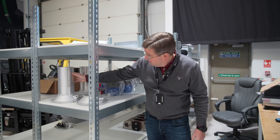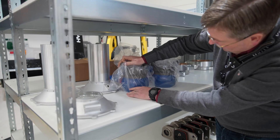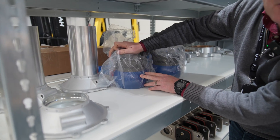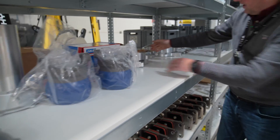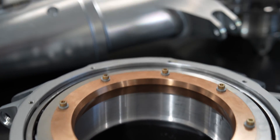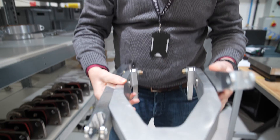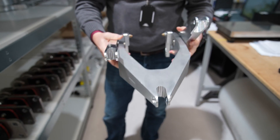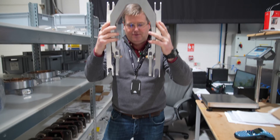We've got the top of the transmission, the swashplate mounting tubes, and the spherical bearings now with their PTFE coating for the swashplate bearings in stock. We've got two swashplate assemblies here, and the jack beams assembled — these are the jack beams for collective and then pitch and roll either side, and the fixed part of your scissor links at the back of them.